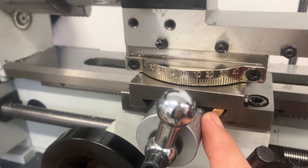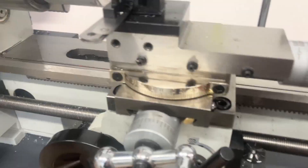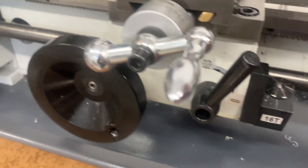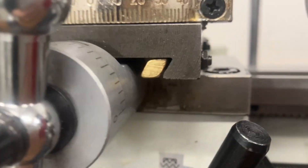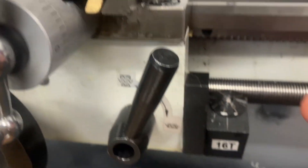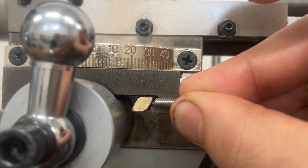Another upgrade I've done is to install brass gib strips just here and here. I find that these make the actions a lot smoother. When you buy them they come blank — they look like this but brass — and they don't have the holes. To make those holes, first you slide the gib in where you want it, then you take the adjusting screws out and replace them with cone point set screws, which you can buy on Amazon, and thread them in. It'll make a center point exactly where it should be.